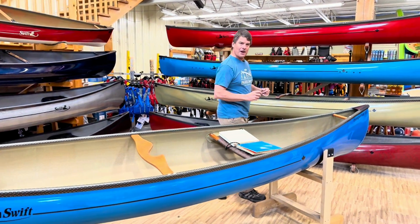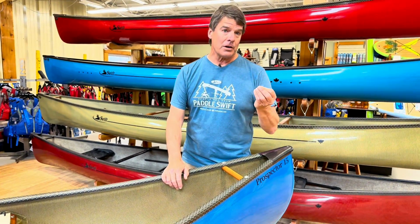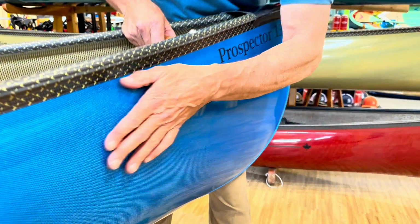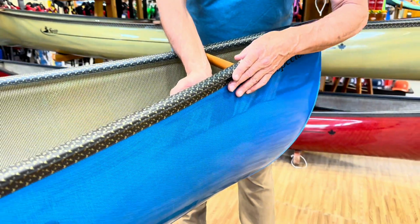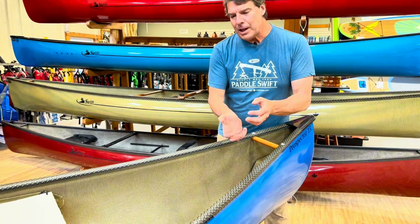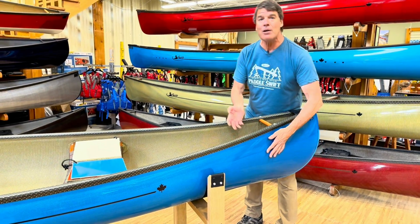Let's start out with this though. We've come out with some new technology this year, and I'd like to thoroughly go through how we build our composite boats. The first thing we do is put a surface finish on our molds, which in this particular case is a very thin application of a clear finish. This one has the sapphire blue behind it. It's a Kevlar fusion boat, so all the layers of the cloth, the core, the ribs get put in behind the clear coat finish on the outside of the hull.